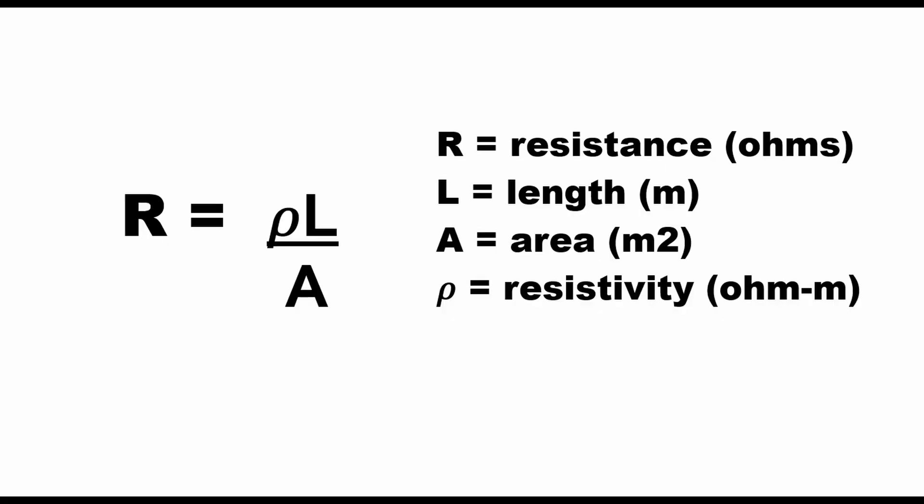This is the formula we're going to use to figure out resistance. I'm just going to quickly point out that the sound quality isn't going to be different between thicker or thinner wires — so we're just looking at resistance. Someone might say a wire with lower resistance might sound better, but I don't agree with that. You can believe that if you want, but we're just going to look at resistance here. So: resistance equals resistivity times length of wire divided by the cross-sectional area of the wire.